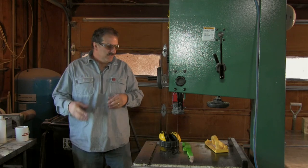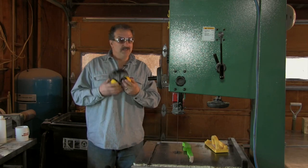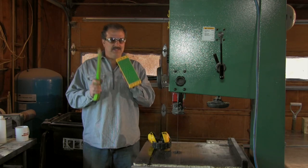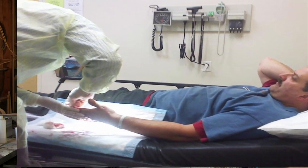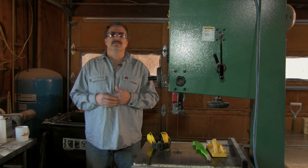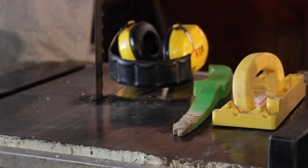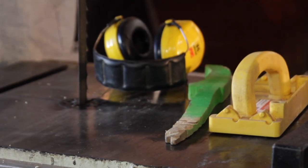A few of the things that you have to do before you even turn on the saw: you have to have your safety equipment — your eye protection, ear protection, and your push stick and push pads. These save fingers. Years ago when I was just starting off, safety wasn't really a concern of mine until I had a couple of emergency runs to the hospital. Fortunately I still have my fingers, and I want to save your fingers. Safety is necessity. So above all else, safety equipment.